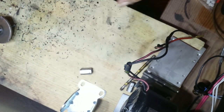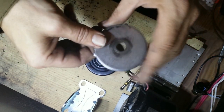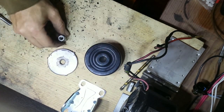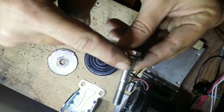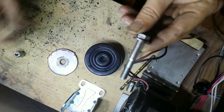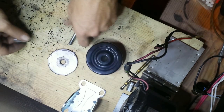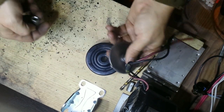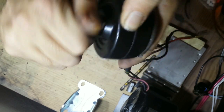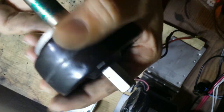Make it a little bigger so the coupler can fit in there. Now we're going to press it on using a piece of metal — you can use any piece of metal, put a hole in it, your coupler, and a bolt. Ideally you want this threaded all the way down so you can just work this all the way in. Put the bolt through the plate and screw that on; you can grab this side with a wrench if you need to.